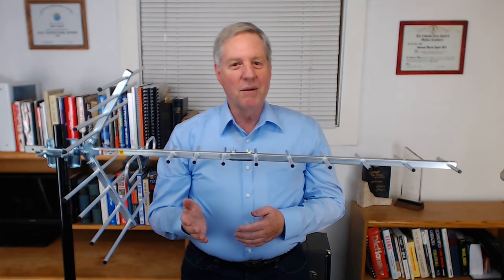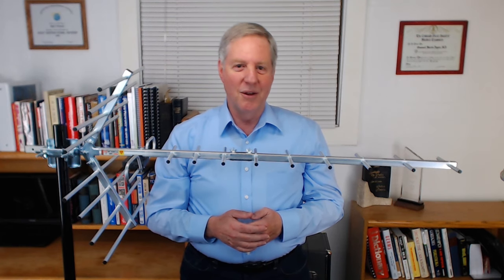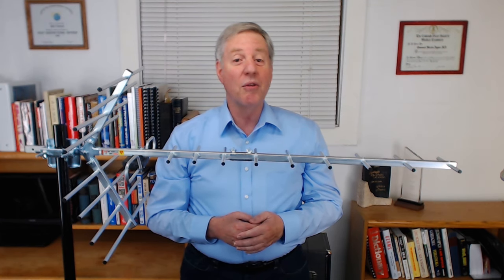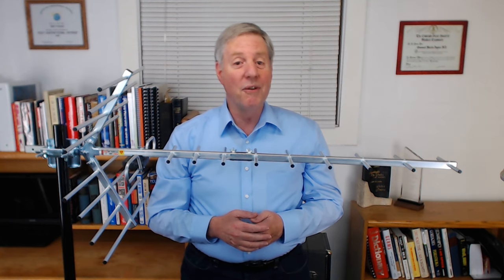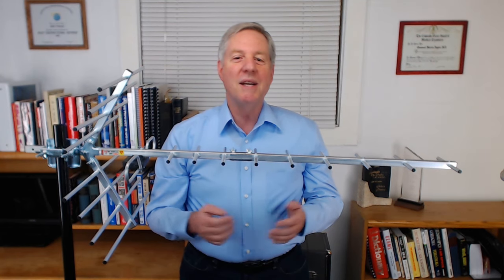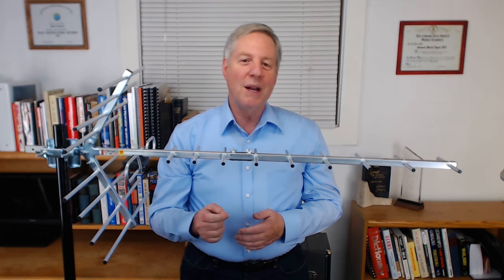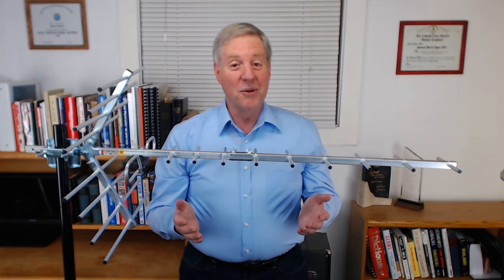From a performance perspective, don't be fooled by tiny 12-inch long antennas advertising 150-mile range and related gimmicks. At approximately 44 inches in length, this model offers nearly three times more UHF gain as smaller antennas with 12 to 15-inch booms advertising 150-mile range. This HD TV antenna model, due to its more powerful focused abilities, is great for customers seeking high range or trying to pick up harder-to-reach areas of interest. And it's upgradeable too.